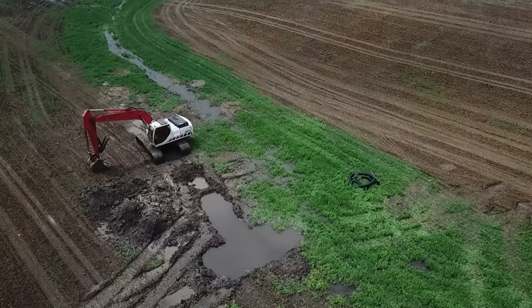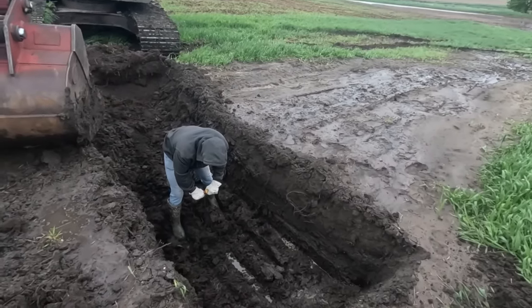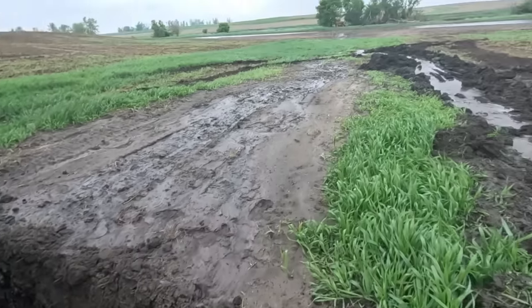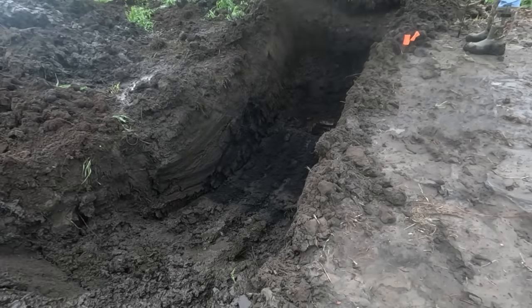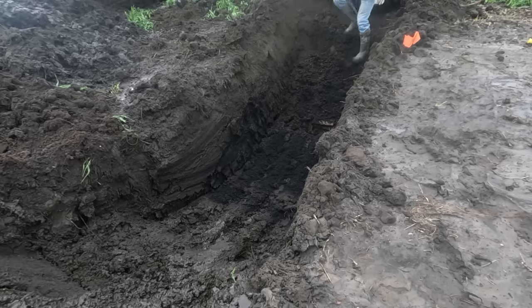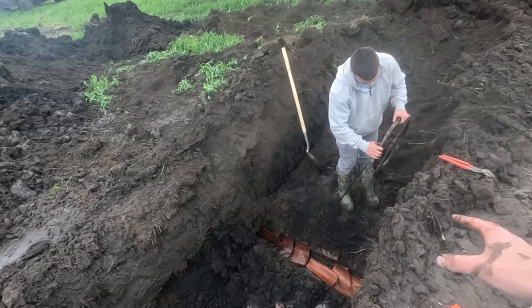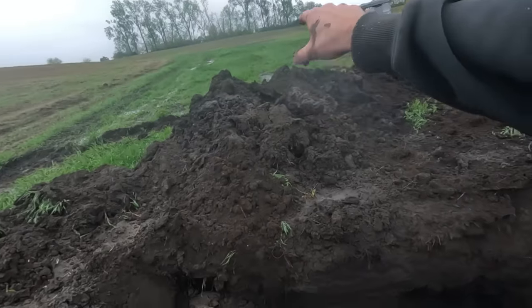Diverting some of the water coming off the waterway. We're back to where I made this fix, and we're gonna rule this out. We're gonna rule out that me connecting this didn't make it. We're figuring things out. Oh, there we go. We stuck sewer tape up there. I think this thing goes 40 foot. Nothing, it's flowing good. So that means our blockage is down there.